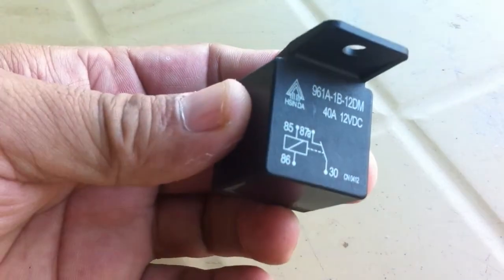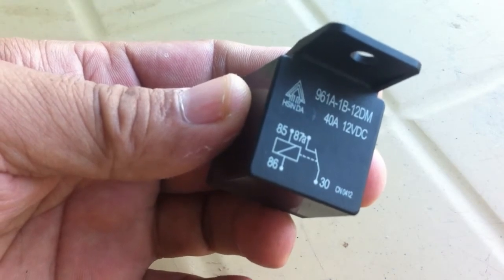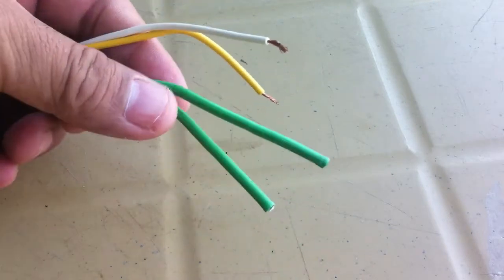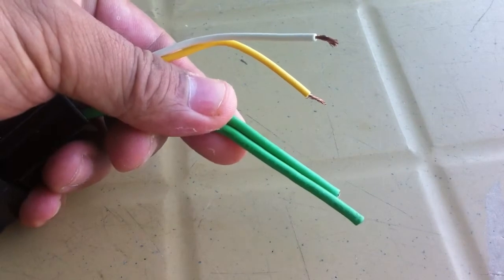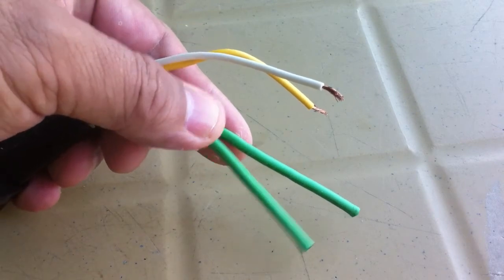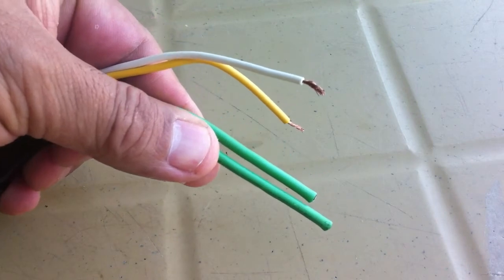Notice the harness. It has two thin wires and two thick wires. There is one other thing about a relay: you can apply a small amount of current to the trigger, but the switch can handle a large amount of current. Of course, from the wires alone, you will know that the thin wires are the trigger terminals.